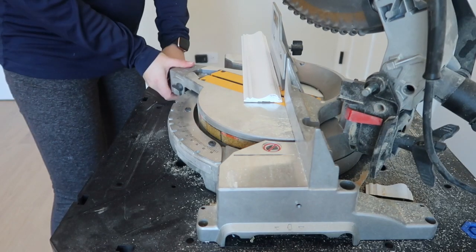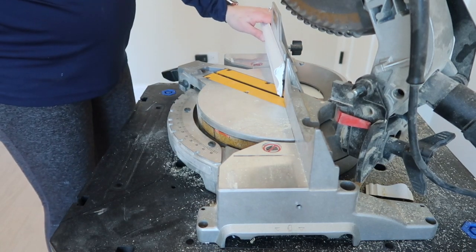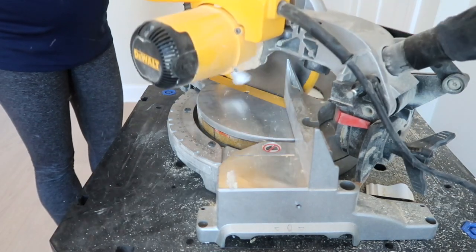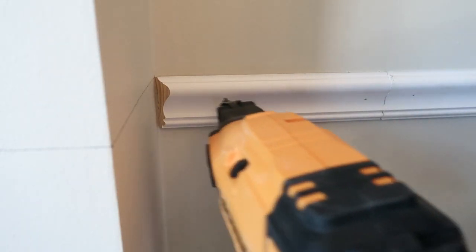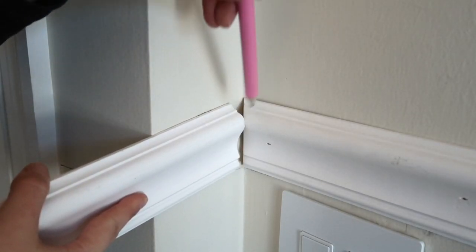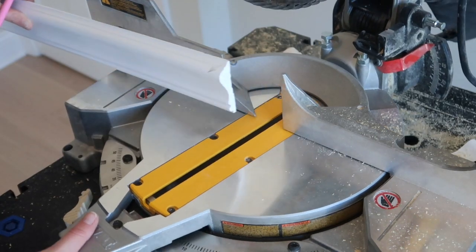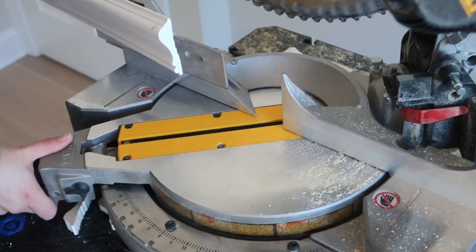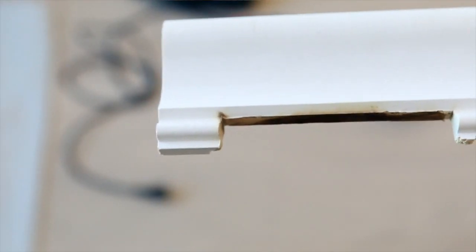Eventually you'll get to a corner. Those pieces will need to be cut at a 45-degree angle on your miter saw so it fits perfectly with the piece next to it, which will be cut at a 45-degree angle the other way. I find it easiest to take the piece of trim to the wall and draw an arrow on it with my pencil so when I bring it to the saw, I cut it the correct way. One piece had to make it around a light switch, so we used the oscillating saw to cut out the excess wood.